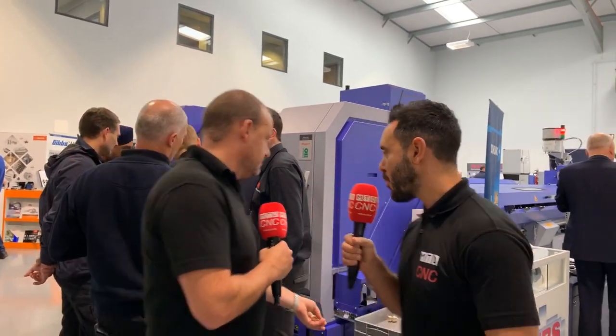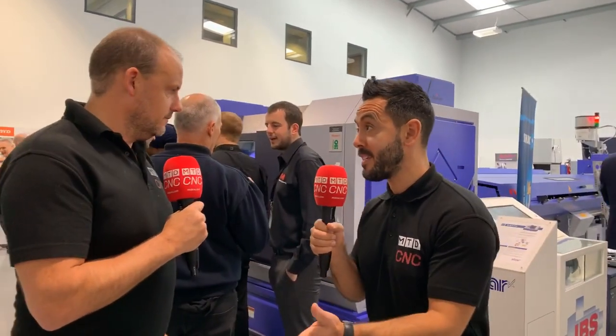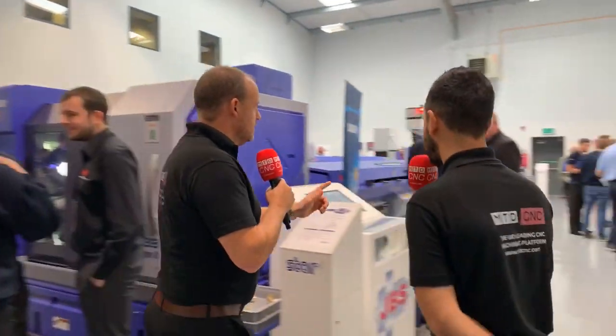And this is another point I would make. Years and years ago, I used to sell sliding head lathes, 32mm machines. You might get to 36. I remember selling a machine and someone saying, wow, 36mm bar, but now we're going beyond that. We're up to 42mm bar capacity. We spoke to some people this morning that are using Star that previously used fixed head lathes, and it has transformed their business. Well, let's go and have a look at that, actually. Let's just go to...